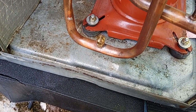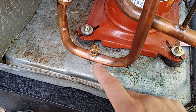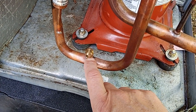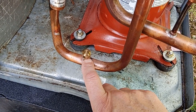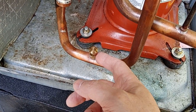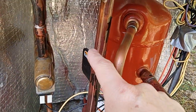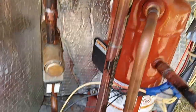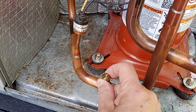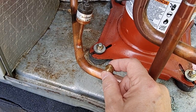I then made the mistake, well, I didn't have much choice, but I put the refrigerant gauge hose on this valve and tightened it down, made a cool call and read 50 psi, which is just a gross failure. When I took the hose coupling off, and these are 1/4 inch flare fittings, there was a geyser of refrigerant that went up and sprayed all over this, clear up here, all the way to the top. So I quickly, I had gotten this extra brass cap because I suspected that was going to happen. I screwed the brass cap on and it did not seal.